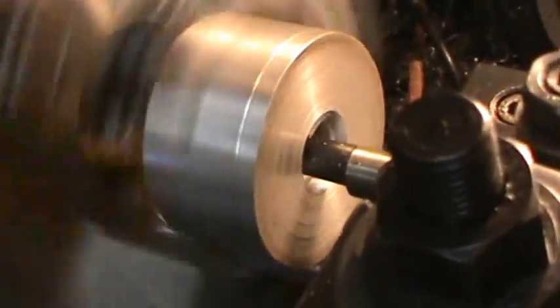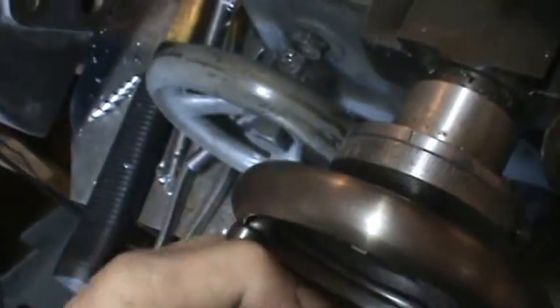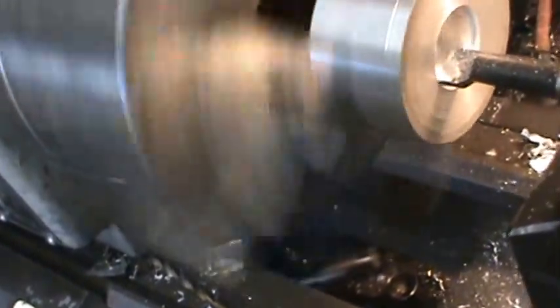Really not important at this point. I've got to get quite a bit bigger, then I'll start measuring it. We'll take another 10, 20. I give 50 thousandths altogether. Yeah, it's taking that much easier. Actually just very roughly just hogging this out. I'm not trying to be too smooth or anything. When I get close to where I want it, then I'll start using more precision.